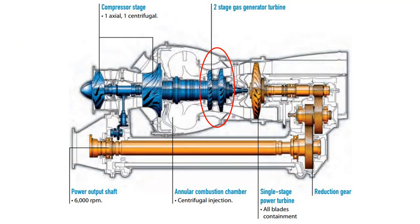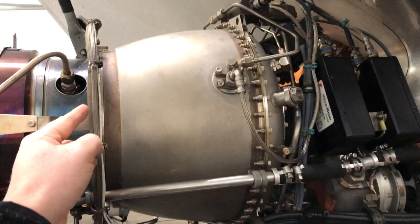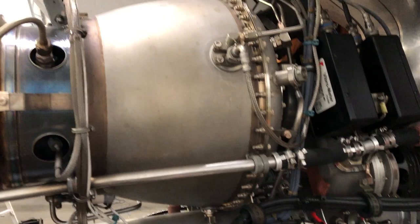But as it comes through here it goes to what's called the gas producer and what that does is as the gas is going out the back it's rotating through a drive shaft and it's turning the compressor at the front. So as that turns, the compressor turns and it pulls more air in, more air in, more fuel in, more bang — so it keeps the engine self-sustained. So that's the energy producing or the power producing side of the engine.